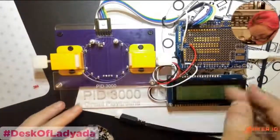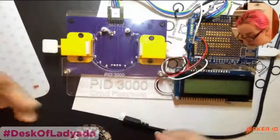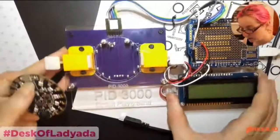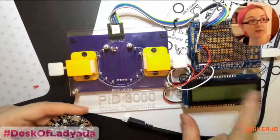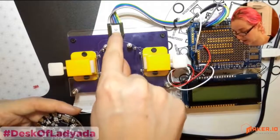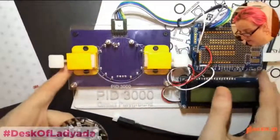Okay, so this is the basic tester I've got going, and I use an Arduino Zero, actually, to program Arduinos, because I have code that can program an AVR over just the ISP pins, and you can bit bang it. It's quite easy to bit bang, unlike ARM chips, where SWD is a lot tougher. And then I have an LCD that helps the person who's testing it. It should be really clear what's going on. And then the pogo bed with little happy faces just tells you, if the cable is plugged in backwards, you'll know it's plugged in backwards. It should be this face up, just a little happy face.